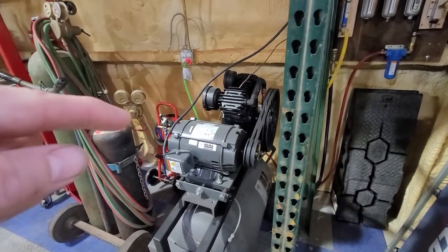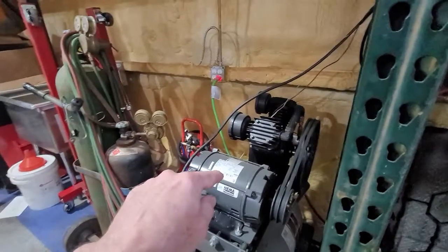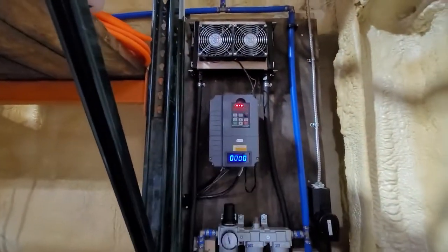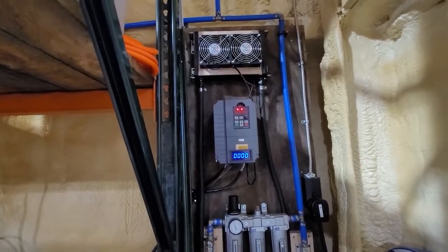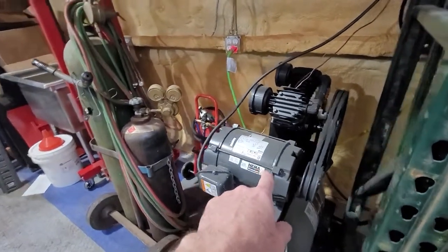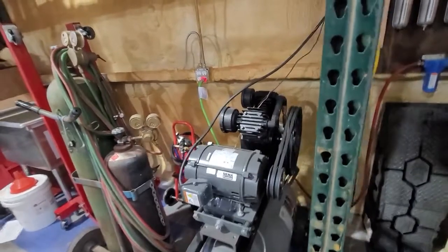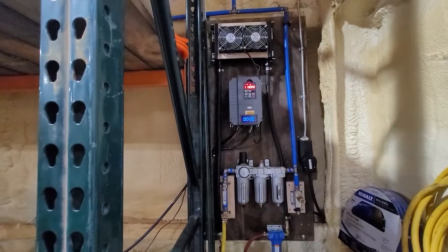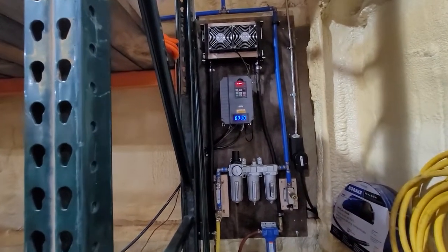To address the timing issue — to get things running at the right RPM and not overdrive or underdrive the pump — and because I have a three-phase motor, I had to add a VFD. That was from Amazon in the $200–$300 range, let's say $300. So: $300 for the VFD, $200 for the motor, and around $150 for the pump head — $650 to $700 total for the whole setup, plus some fabricated mounts. Comparable capacity air compressors were well over $1,000, most closer to $1,500–$2,000.